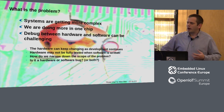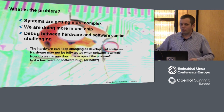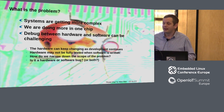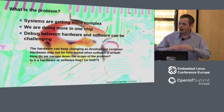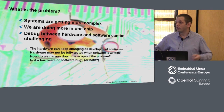The problem we're trying to address is that systems are getting far more complex. We've just brought out a device with six million logic elements — just the logic elements, not counting the processors. We're doing far more on one chip. The debug itself is getting more challenging for a couple of reasons: everything's in one device, so there's limited opportunity to scope things, and because these devices are becoming more and more programmable, things keep changing. Software and hardware are being upgraded simultaneously. It's not a known entity anymore. And the hardware can have bugs too, especially if the hardware engineer is developing their own IP.